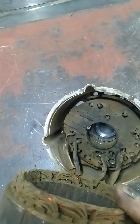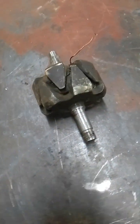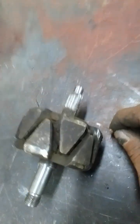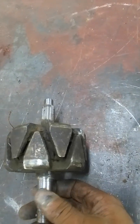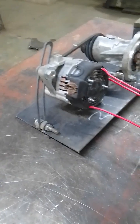That's the basic overview of how the alternator works, how to convert it to a motor, and the difference between star and delta. One thing I've found with these electromagnet rotors is that 12-volt versions work better than 24-volt ones — the 24-volt ones seem to consume more power and amperage and don't seem to supply the required voltage. Unless you have a massive controller, the 12-volt versions work better for these conversions.